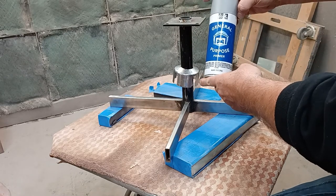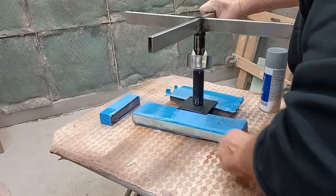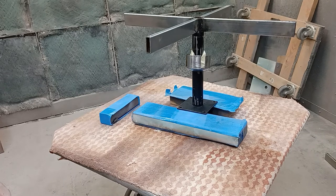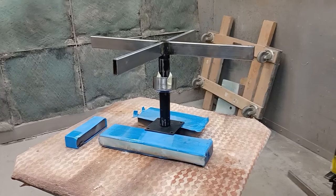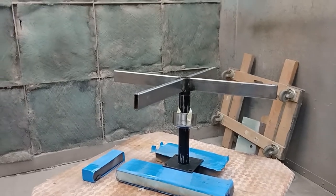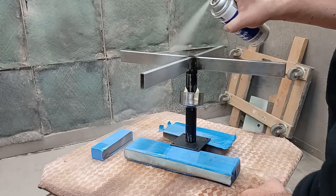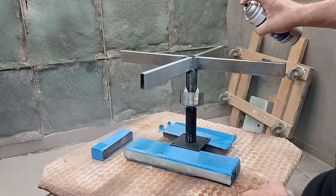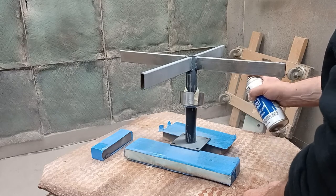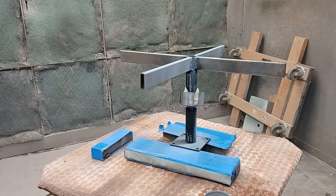I've got my primer — I'm making sure I shake it up and keep shaking it. Whenever I paint, spray, or varnish anything, I start with it upside down and inside out. That's the best way to do it so you can get those areas done without having to turn it over and mar your good work. Flip it over and try to spray from the inside of the piece to the outside, spinning as you spray. Start a little farther away so you don't end up with too much coverage at first. I'm in my spray booth with a fan on, so I'm going with short bursts to get a feel for how the primer lays down. If I'm going to make runs, I want it to be on this part — this is where I learn how the can sprays and how the piece reacts. Every piece is different and every rattle can is a little different too.